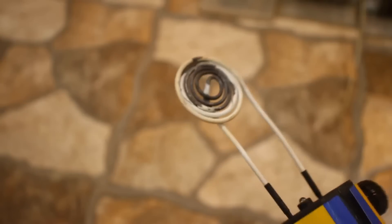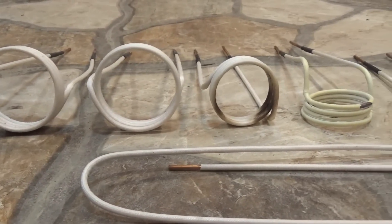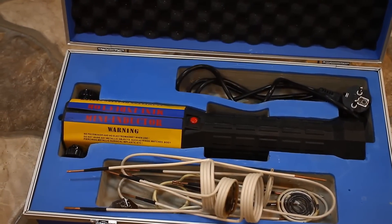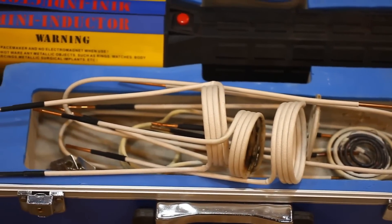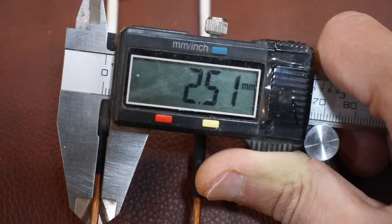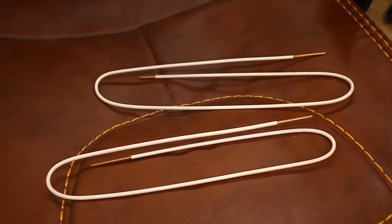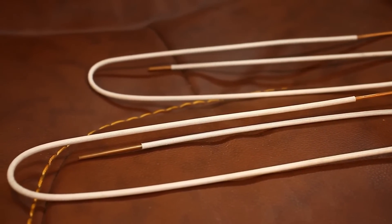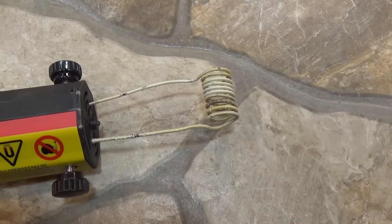That's for the best, since I've been using it for quite a while and can talk about all the advantages and disadvantages noticed. Inside the case is the heater itself, which I thought would be smaller. There are seven inductors included. The wire diameter is two and a half millimeters with heat-resistant insulation. The set also includes two pieces of wire — if necessary, you can wind an inductor of the desired shape yourself.